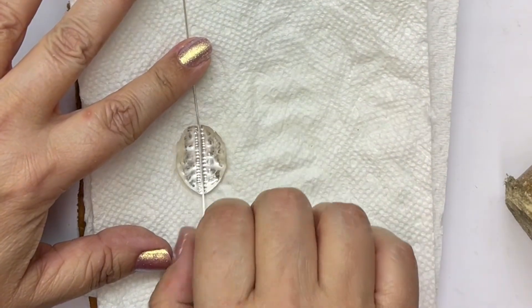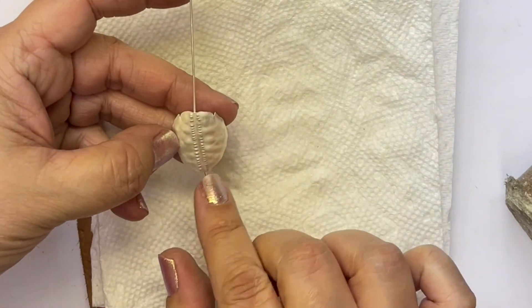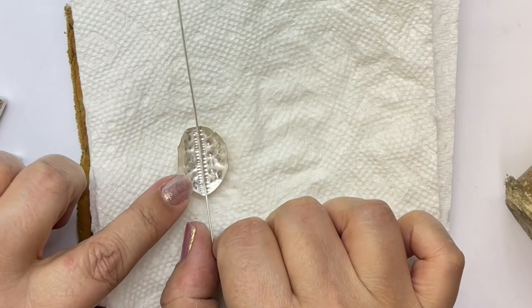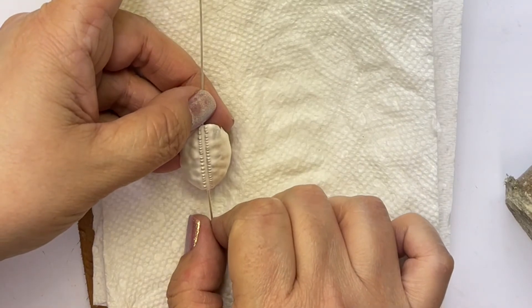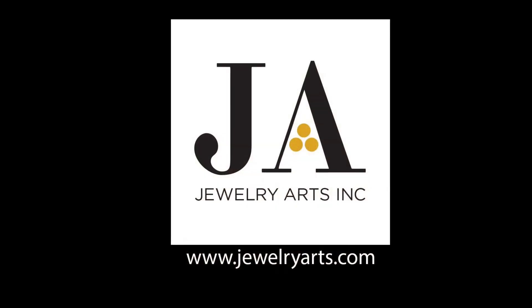What I'm going to do now is anneal this, and then I'm going to start working from the other side. Technically, what I was just doing is repoussé, because this is the back of the earring. When I work the other side I'll be doing chasing, but the movement and everything else is exactly the same.